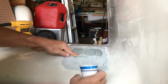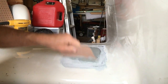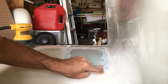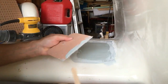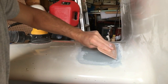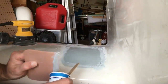We'll go ahead and do the final sanding to the finish line. This should be the last one unless we find some more low spots on our final inspection, but this should be it. Normally it takes two tries to find your low spots with your leveling technique, and then the rest is finishing.